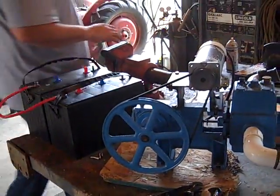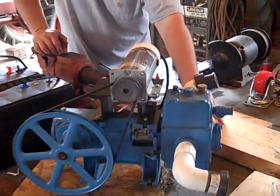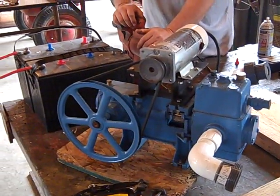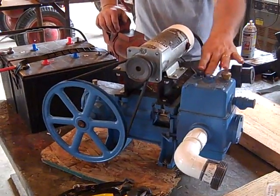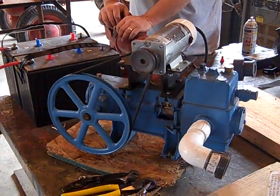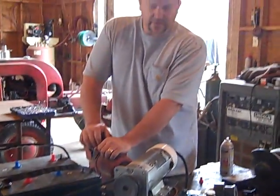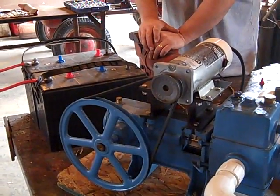So this is the 24 volt solar force piston pump. I'm looking forward to just tearing it down, replacing the leather cups on the pistons and the seals, making sure everything's good — but she sounds beautiful, nothing wrong with it. It's got its own pressure relief valve, so I'll be putting a pressure switch in. I think I'm going to run my house off of this. I'm thinking of adding this to the collection of off-grid solutions, using batteries and a solar charging system to keep the batteries maintained.